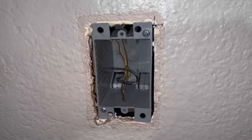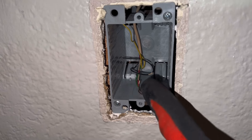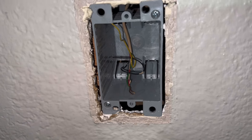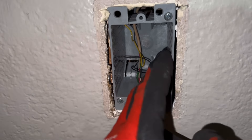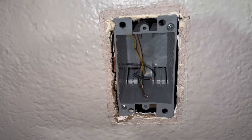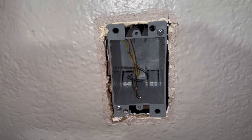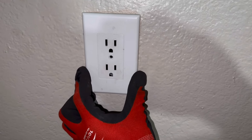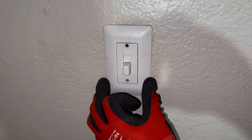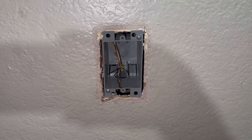There are some individuals that like to add extra security to the box by putting a drywall screw going sideways into the wood stud. This is up to you depending on what you're trying to accomplish, but as far as I've been using these boxes they've been very good and very secure. This eliminates you having to do any damage to your drywall. Put your outlet cover on and you won't even be able to tell there was work done. If this video was a help or informational, please subscribe.